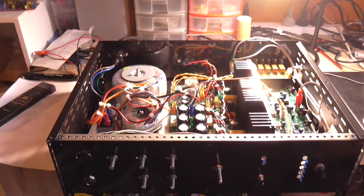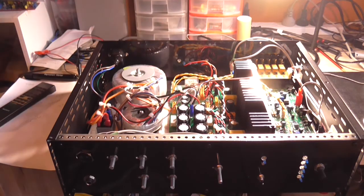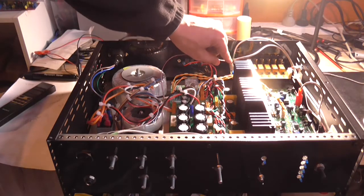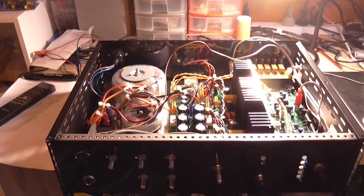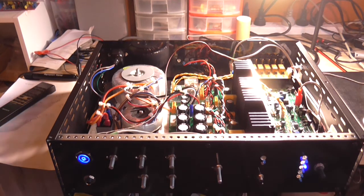Okay, that DC wire is put in for the 20 volt rail there. I think they provided that 20 volt DC rail there for their own input selector in their ultra low distortion amplifier project. Now, I just want to poke that out of the way somewhere. It's not going on. So we power it up now, and the sub's now connected. Let's see what happens. Brilliant. Okay, so it looks a little bit better with that power switch LED illuminated. That was the general idea. I reckon that Protect LED's brightness is a bit bright compared to the rest, but yeah, anyway.